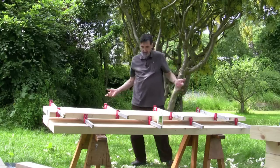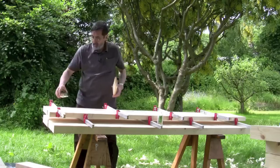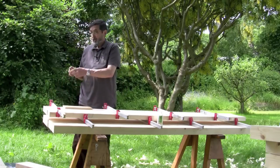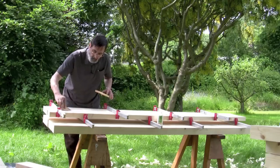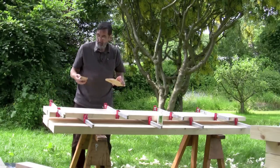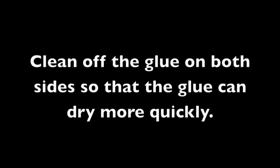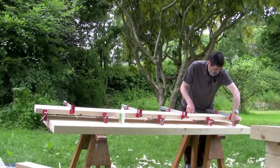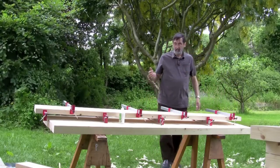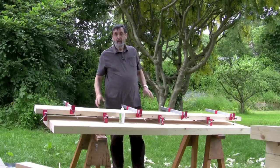This is no nonsense, just straightforward. I like to take off the excess because it slows down the gluing time, so if you have too much excess go ahead and take it off. That's great — now I just have two more to do and that'll be my aprons and my well board done, ready for the legs now.